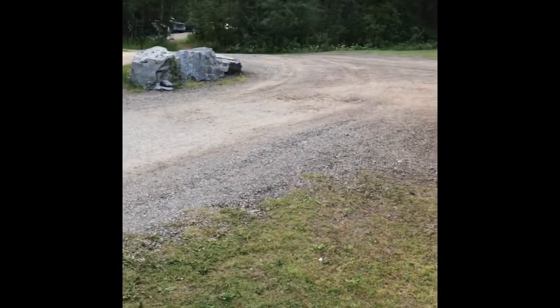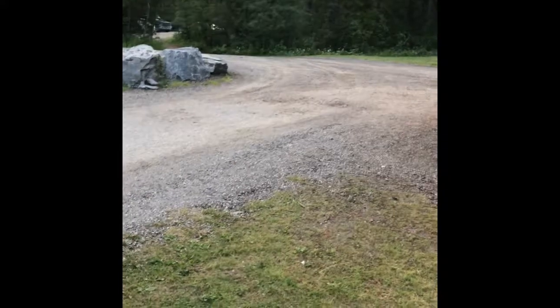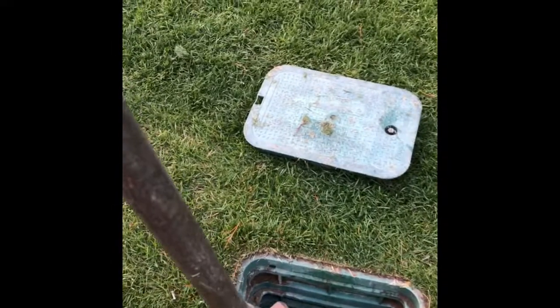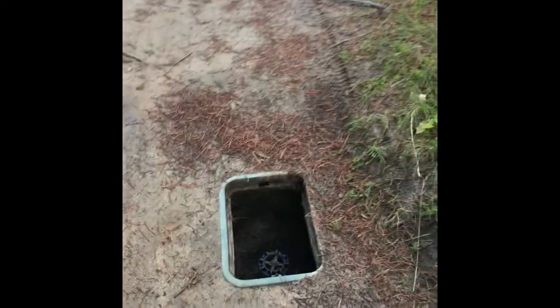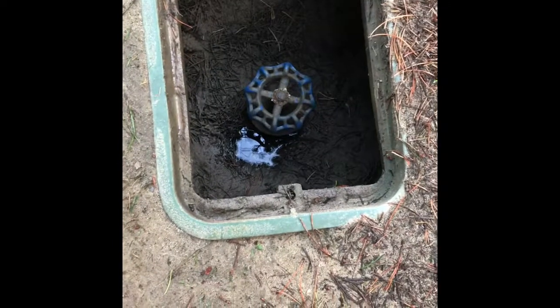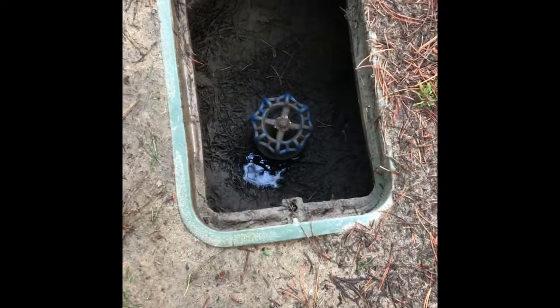So we have determined our 16th valve is the one that needs to be replaced. In order to do that, we have to close the valve on number 12 here. We do that with this, and that will isolate our valve that we will be replacing. Here we are at the valve on 16. You can see that it's leaking a little bit. This valve is currently isolated.